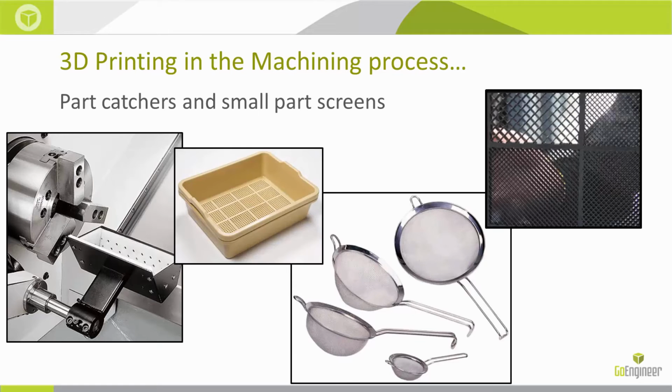A lot of lathes have mechanical parts catchers for larger parts. These are devices that move into position under the spindle and wait for the part to be ejected, and then convey it to a tray in the door so the operator can remove it from the machine without having to open the door. This type of device is used to increase the efficiency of the machine. The problem is, a lot of them are made of metal and introduce the opportunity for damage. One could print a liner that would allow cutting oil or coolant to pass through and still catch the part without damaging it because it would be a softer material. Again, these are great applications for FDM.